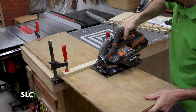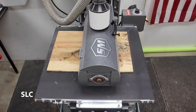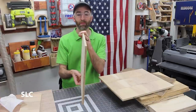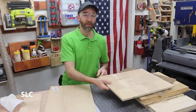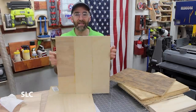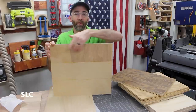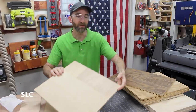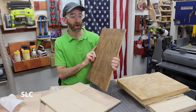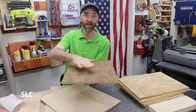Use whatever you'd like. When you're gathering your wood for your shelves, chances are they're never going to be seen, so you don't have to use perfect wood. For example, this is a couple pieces of real thin plywood that I've glued together — nobody will ever notice. This right here is actually three separate pieces of long plywood glued edge to edge. Normally this would not be a good suggestion, but considering these will be the sides and the wood runs to full width, they're just joined in the middle and will be perfectly fine. Also, don't forget old wood from old projects you might be throwing away or disassembling. If one side is ugly and the other is already nicely stained, just make the stained side the top. Use the wood you have, especially when lumber prices are kind of high.